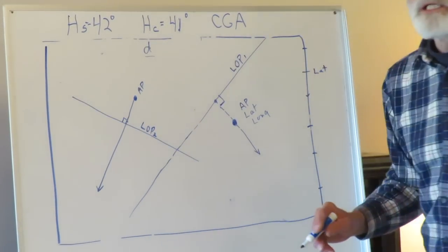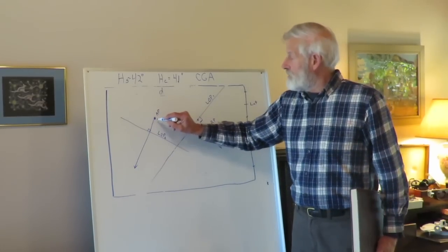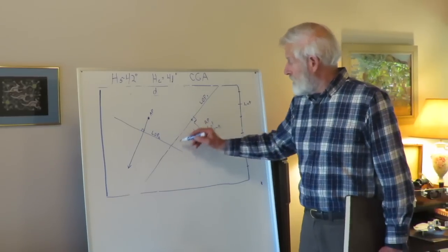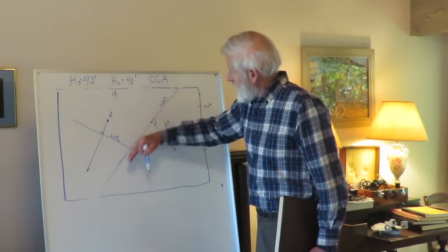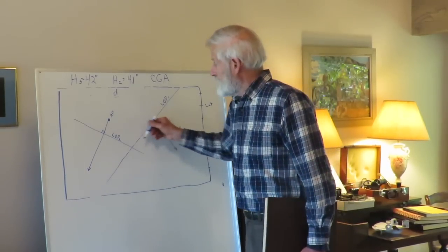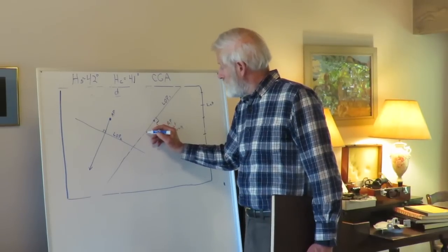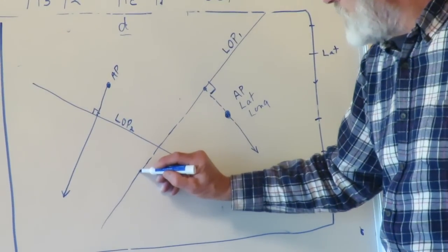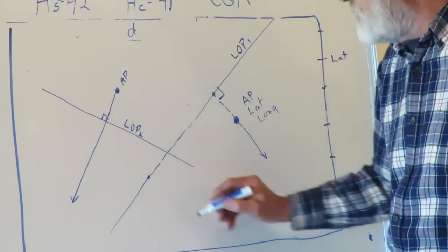I know there's one question that you all are kind of wondering. It comes up frequently. We took this sight in the morning, we sailed all day, and then we took this sight. What do we do about that? Obviously, by sailing all day, this LOP is not accurate anymore. Well, it's a simple process to advance your first LOP. It just takes a minute. Less than a minute. You can take any point on this line, any point on your LOP. Doesn't matter, you can take this point if you want, but you can take any point on your LOP.